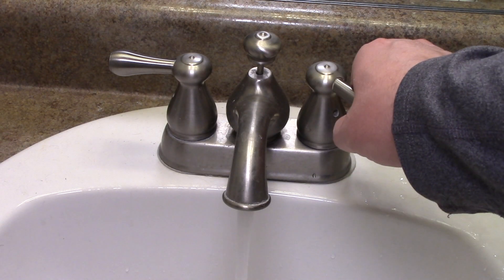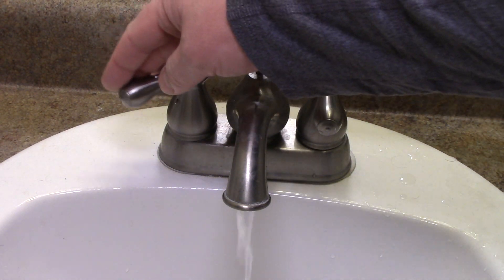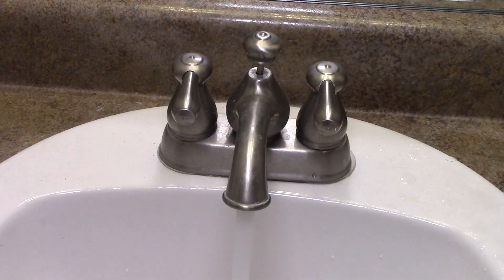Now that we've assembled our three-valve system, we're going to turn off the water and then go to the sink or faucet at the lowest point in the house and open it so all the excess water drains out. That way, when we cut the pipe we won't have water spilling everywhere. Do this with both the hot and cold water and leave them open while you're working, because even if it seems like a trickle, that's still going to be a lot of water coming out.